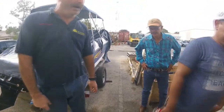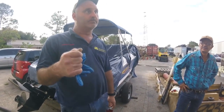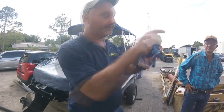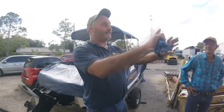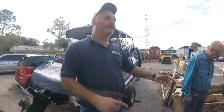Yeah, usually when I prime out, I do about a click and a half a second. Boom, boom, nothing faster than that. Anything faster than that, the concrete will jump over the water. Too slow, and it'll just push the water and it'll half moon in the pipe. Nothing on the ceiling. Plug you. You want a mediocre speed.